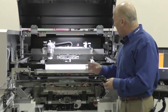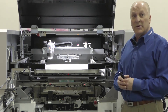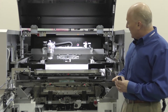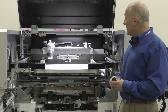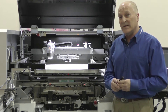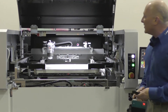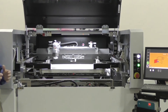Very simple auto width adjustment. We also have both top clamp and side clamp capability with this particular platform. The board handling system is an adjustable conveyor mechanism which aligns to the stencil. Once the stencil is positioned, the camera system is an upward-downward looking camera system — very consistent with Fuji's other product lines as far as modular technologies and capabilities within the platform to be able to recover from any kind of transition.